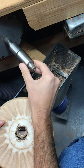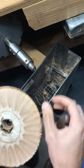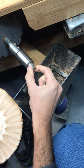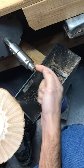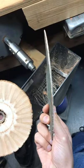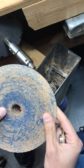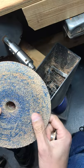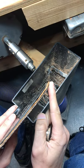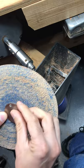This one we just have it where we can put a direct mount onto this custom arbor. I forgot who made this — it might have been Tim West — but basically if you have a metal lathe you can create this arbor yourself and cut threads so it goes in there. This disc is a little bit wobbly, but it's fine. We're running at such high speed and using it to grind briar, so we only really need the flat face. Where you want it straight — where you don't want it bending — is when you're doing detail work on a pipe.